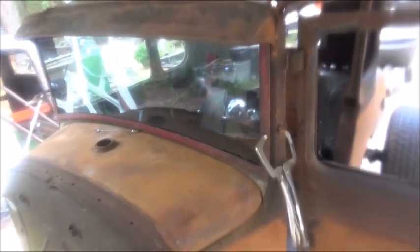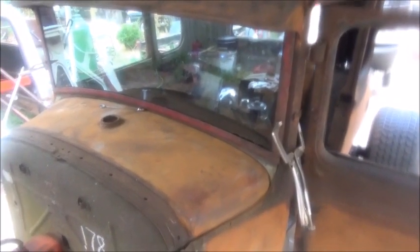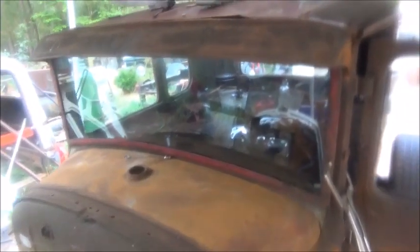And let me see, we're working on the windshield. We've got the frame sitting in there and clamped in lightly and got it blocked about a 1/4 inch off of the bottom, which from one of the pictures I see looks like about where it's supposed to be. So we're working on making a mount for the hinge to get all that mounted in. I want it to hinge. I don't want to put it in solid. So that's why we're going through the trouble.